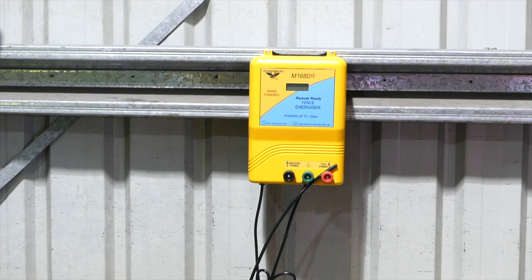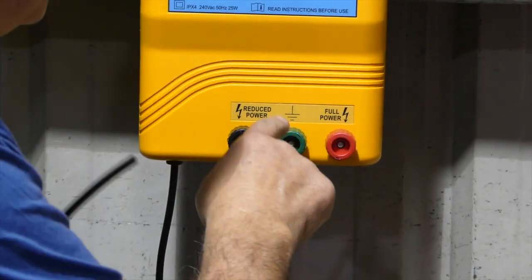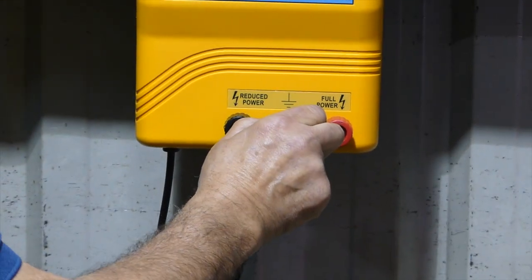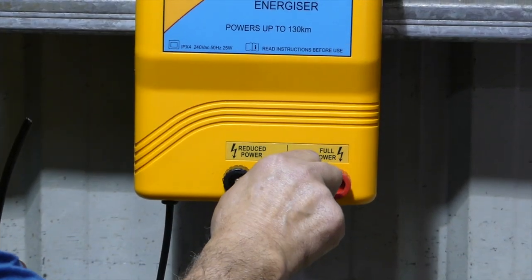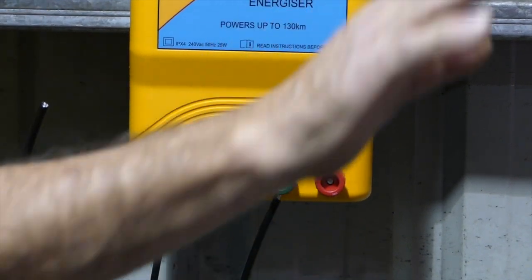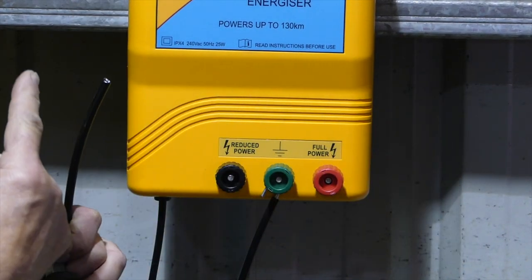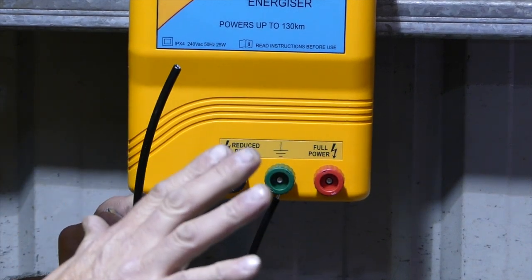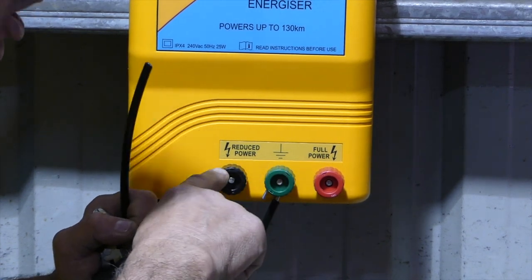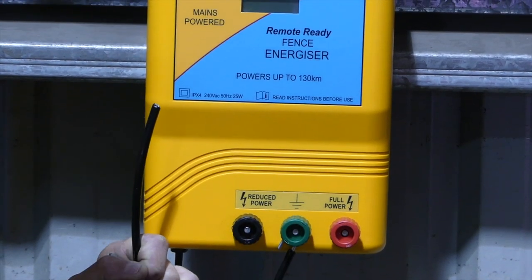I've pre-connected our earth wire to our earth terminal. This energizer, being the larger unit, has three terminals. It has your earth terminal, which goes to your earth stakes system and non-electrified earth wires in the fence line. High power is the full power terminal, which would go to your property. You could run a third wire if you wanted to run a separate fence around your horse paddock or your house paddock, where you've got kiddies around and you want a safer system because it's a lot lower voltage. That could run to that paddock only, and the full power goes to your property,